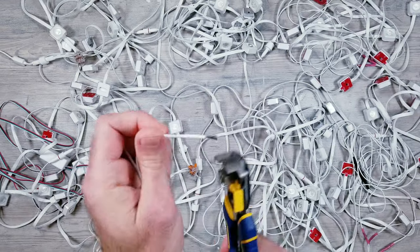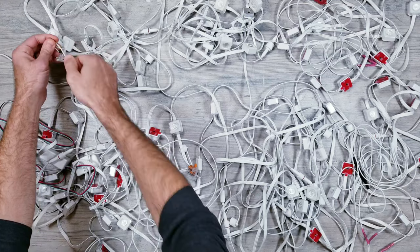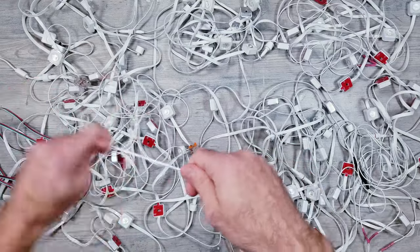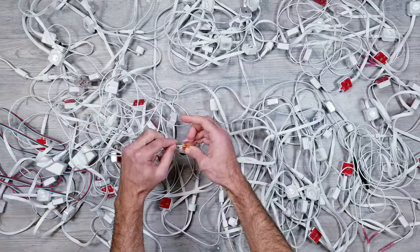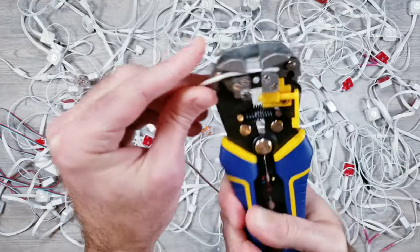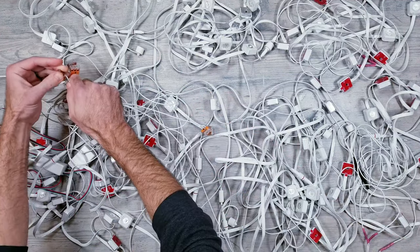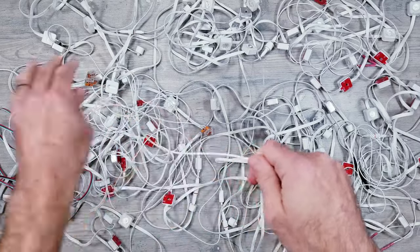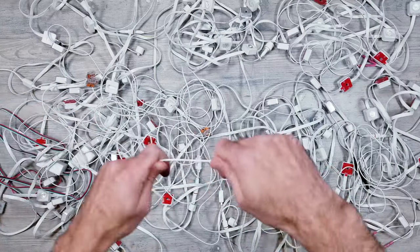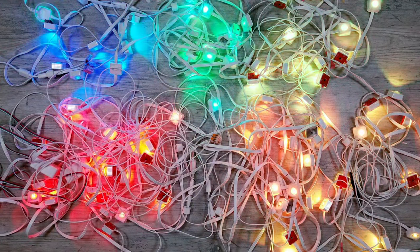And finally, I was curious to see what would happen if I instead used about 25 feet of wires to inject power instead of the 4-foot long sections I was using. And sure enough, no flickering and everything looks great.